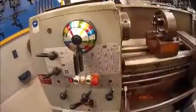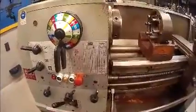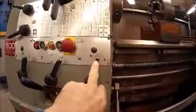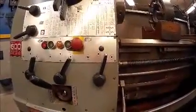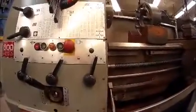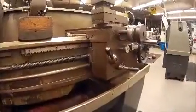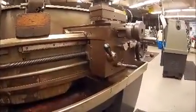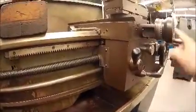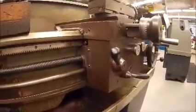When we start using these machines, if you've never used a lathe before, one of the most important things is to ensure you have the machine in the Y position on this lever. The reason for that is it disengages the lead screw. With the lead screw disengaged, should you accidentally bump the lever on the carriage, you won't accidentally engage the clasp nut around the lead screw and have the carriage travelling off down along the machine at an accelerated rate.